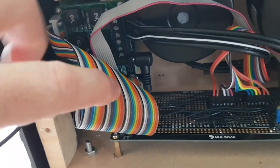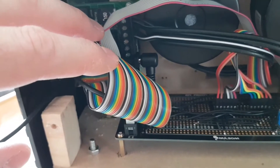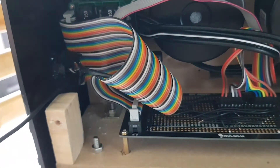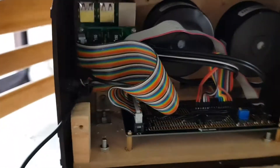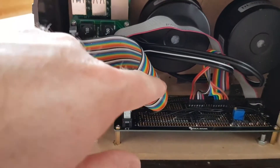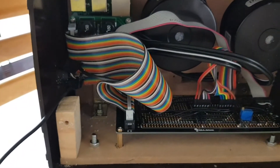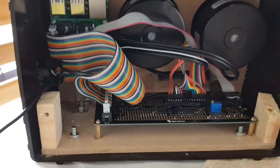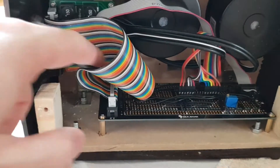The last thing I did — you can just see the power supply going into the HiFiBerry hat that sits on top of the Raspberry Pi. The amplifier needs a lot more power than the Raspberry Pi can provide, so you feed the power into the HiFiBerry and it in turn passes whatever power the Pi needs down into it.